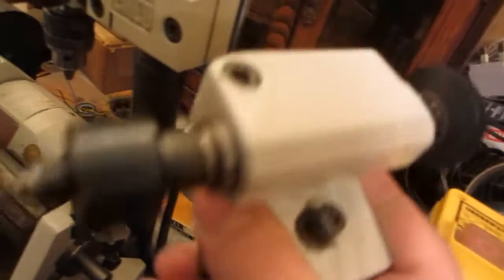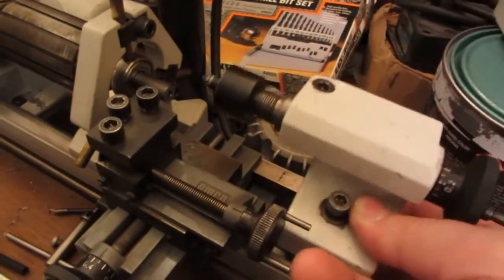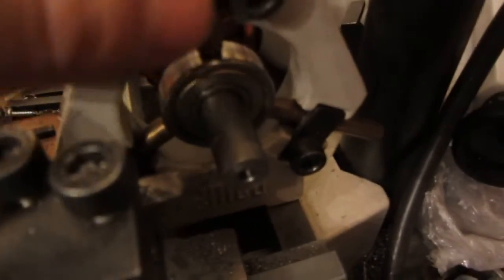That's how you turn a motor shaft down when there's no way of holding it in a center. Normally you'd hold it with a revolving center that goes into a hole, but with this it's not possible because I need the carriage to be in the area where the tailstock would have been. There's no space to put the carriage in place to do the turning of this shaft, so the best setup is to put a bearing on it and clamp it into the fixed steady.